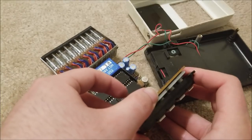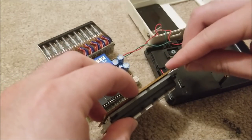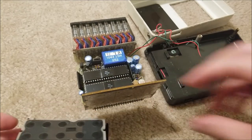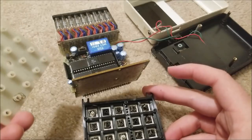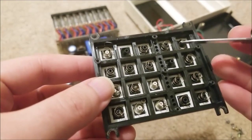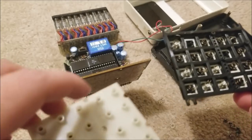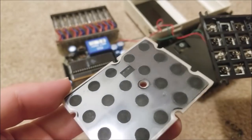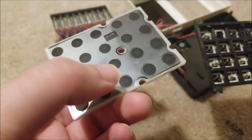Now we should be able to unscrew the button board — it's a little crusty. Oh wow. I am not going to be playing Pick Up a Million Springs — let's try to get this off in one piece. Some of these springs already started popping out. Well, that is no fun at all. You can see there's a big outer spring, and some of them have a smaller spring that actually goes in the hole. I don't want to lose any of these. If we just look on the bottom here, it's carbon film — that can definitely be cleaned up. There's probably some dirt and grime under there.